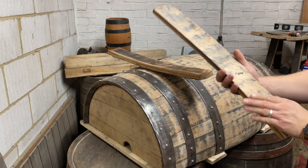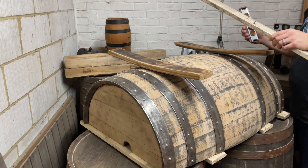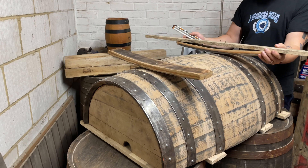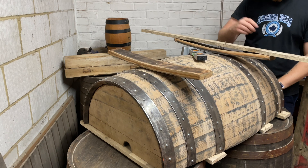To prepare these staves, all I've done is taken a grinder with a sanding disc and lightly gone over them to take the top layer off — the same process I normally use with the barrels, as you've seen in the earlier videos on how to sand the barrel. It gives you that lovely wood grain. Try not to use a brand new sanding disc because they can cut too deep and you lose a lot of the wood grain detailing. Rough them up a bit on a spare piece of wood or some metal — just dull them up a little. You could potentially use lower grit sandpaper, but I use what I have and it works.